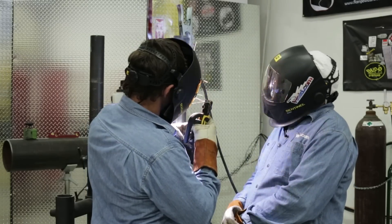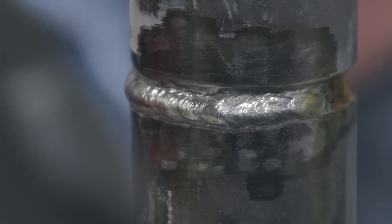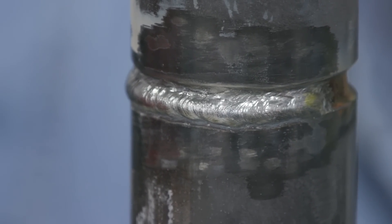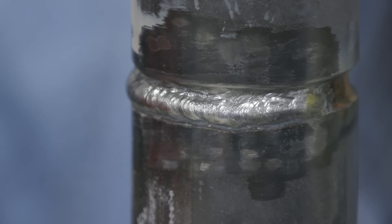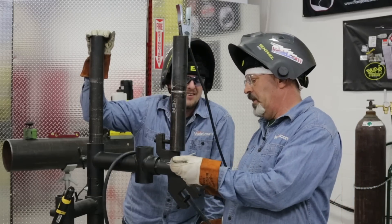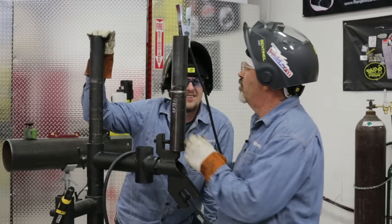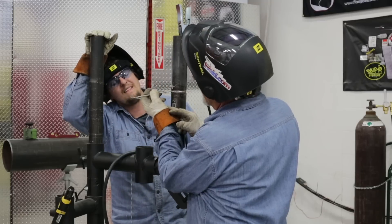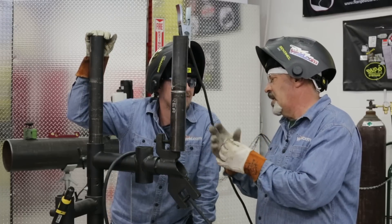I got porosity — a little hot start there, huh? I got bad porosity, but then I started understanding what was going on again. It's been a while. What was the porosity from — long arc? It's working and then it's shutting down. If you long arc it, your flux is not going to create that atmosphere around the start of your pool. I noticed you're pinching your electrodes off back here, knocking about three or four inches off to be steady, and that's cool, but we still have to be fast and accurate. When you start, you want to strike the arc and set it in there close. You don't want to long arc it.